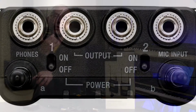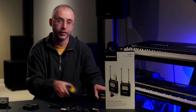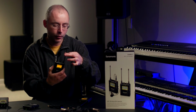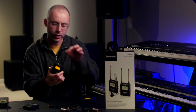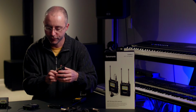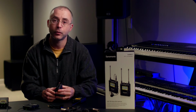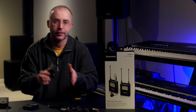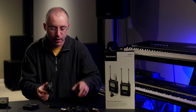And this is also a digital system. And this is an analog system here. So in here, you have one single antenna for this and one single antenna for the transmitter number 2. Okay, so this is the difference. And this probably explains why I'm having the audio dropouts at X distances.